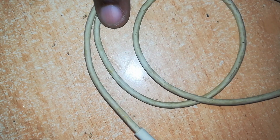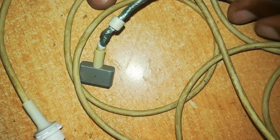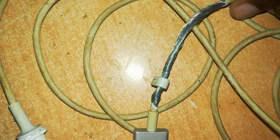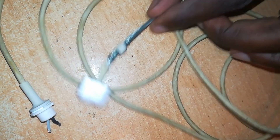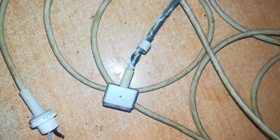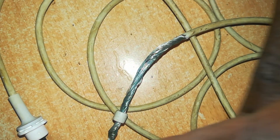As in all my repairs, the first thing I do is make sure that what I'm working with is actually practical — that is, if the parts are working. I've confirmed that this MagSafe 2 cable connector is working, so the only damage I need to replace is between here and there. What I haven't confirmed yet is whether this charger board itself is working, so I'm going to open it up and test it for input and output.